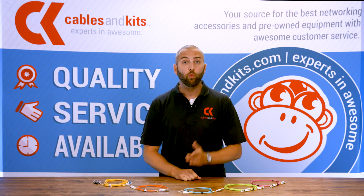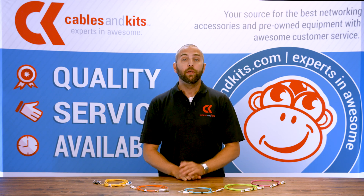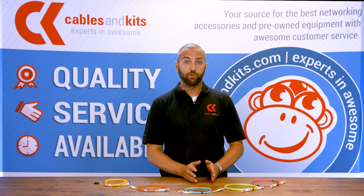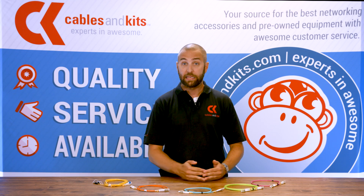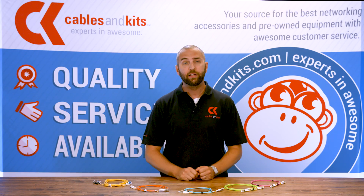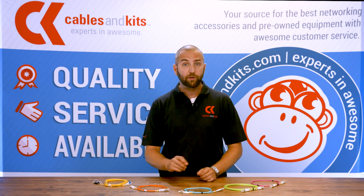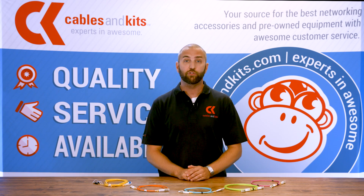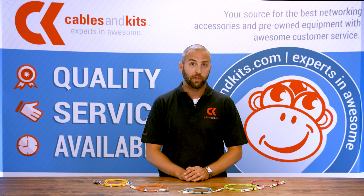The second topic is application — when do you use a fiber cable? That depends on two things. The first thing is EMI. Some environments where you're deploying have electromagnetic interference. If you run a copper cable next to anything like a motor or a fan, you're going to get a lot of distortion in your signal — it's not ideal at all. Fiber cable will completely solve that. Because a fiber cable uses light instead of electricity, EMI is a non-starter, completely out of the equation when utilizing a fiber cable.